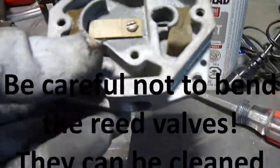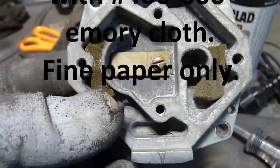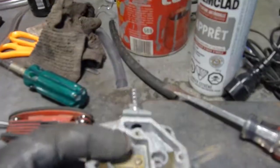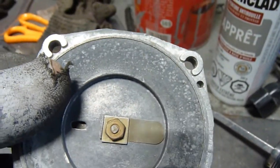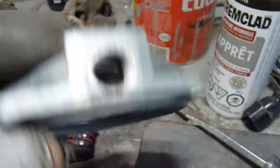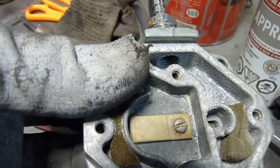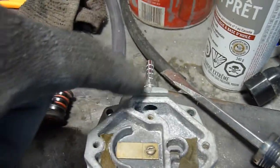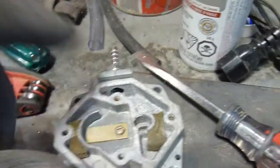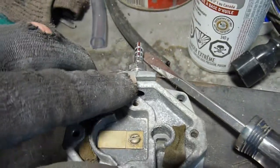The head is now a lot cleaner than it was. It has one reed valve on that side with those little foam filters you can see, and the other side going the opposite direction is the other reed valve. So this is intake on this side and this is out on the other side. The porting in the chamber determines which is which — this is outflow with the arrow, and this is inflow.